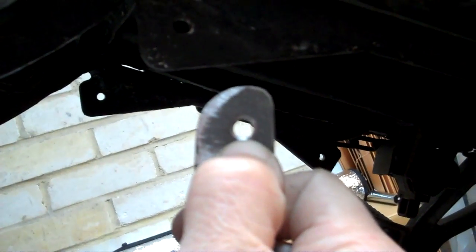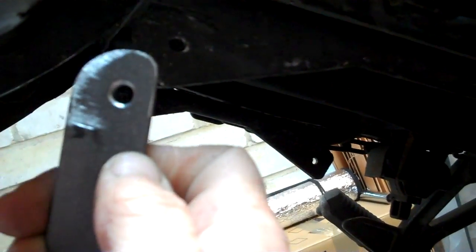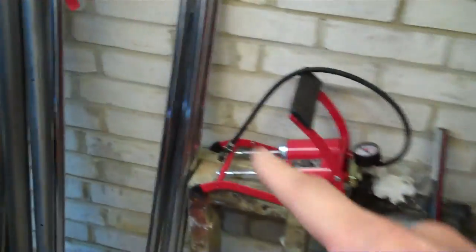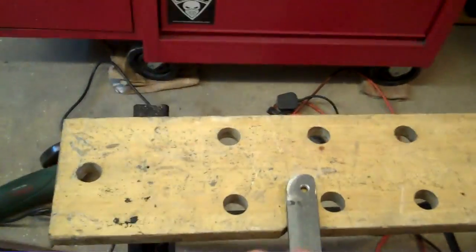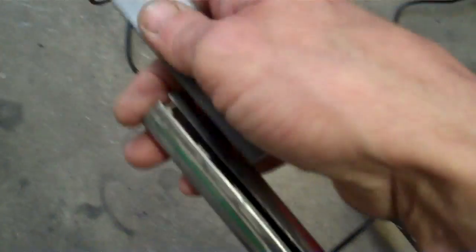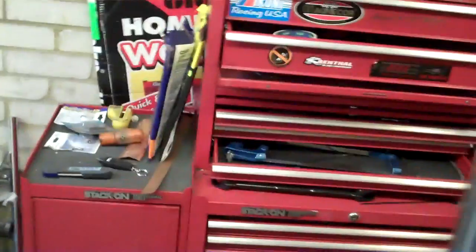These being quarter plate are nice and strong. These holes will be bigger — they're only about six mil and I'm not going to bolt on a tow hitch with six mil bolts; they're going to be eight mil, I'll just lob them out a bit later on. I haven't got a sharp enough eight mil drill bit so I'll whack them through at that for test fitting. Now these have got to be welded into the tubing — I'm going to use this mild steel tube because I can weld it better than stainless.